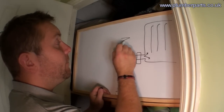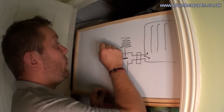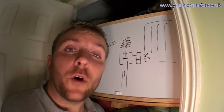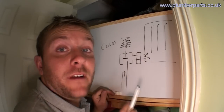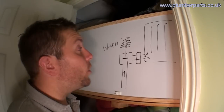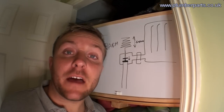We have a spring that is made of metal that is very susceptible to the temperature around it. If the room is cold, the metal will be contracted because when metal is cold it is contracted. Therefore, the valve jumper will be open and hot water will be allowed to flow into the radiator. If the room is warm, the spring will expand and that valve will be pushed down and the flow to the radiator will stop — and that's how they work.